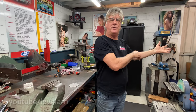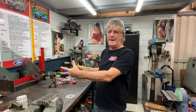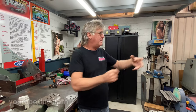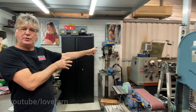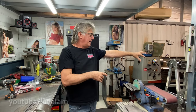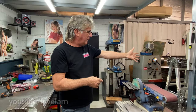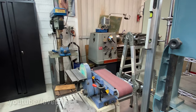So I've gone through quite a process from a blank CNC bench in the Colchester ready to assemble, sort all the blades out, manipulate all the blades so they're as even as you possibly can get them and they're helix correctly. Then load it into the reel on the Colchester. It's just a fixture to do that with. Then out of the Colchester, they find their way onto my brilliant ladder stand, awaiting the welding procedure.